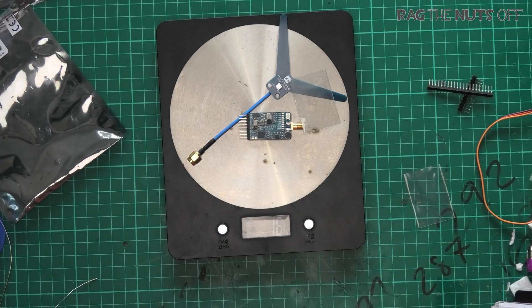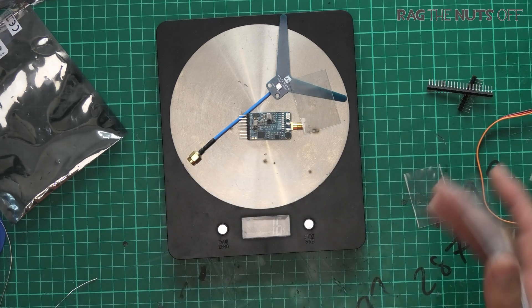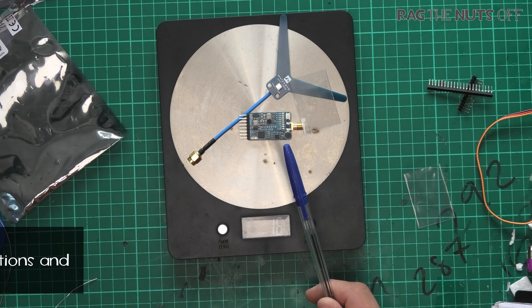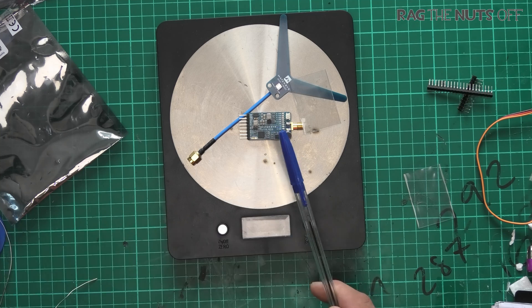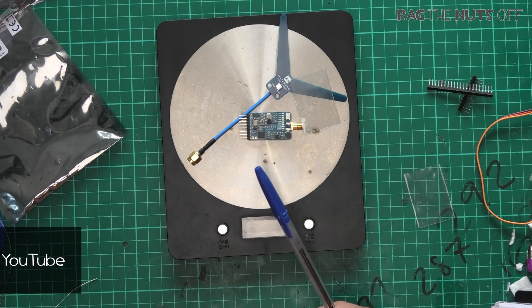With the antenna and a plastic sheath added, we're talking 16 grams. Comparing this to the Padron kit and other 1.2 GHz video transmitters, the whole system is probably less weight than just one of those transmitters alone. These transmitters have a power rating of 630 milliwatts — for those used to 5.8 GHz that might seem low, but there are plenty of videos on YouTube showing you should be able to get the best part of 20 miles, probably more, on a transmitter like this.